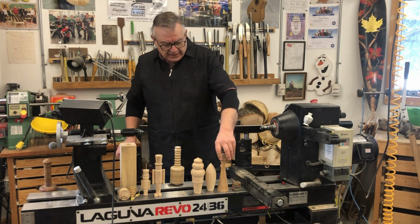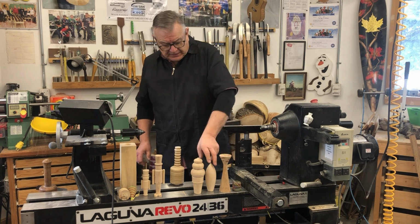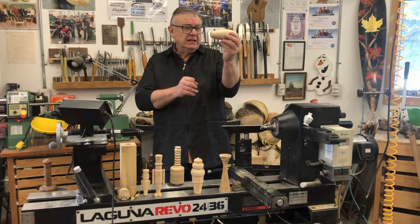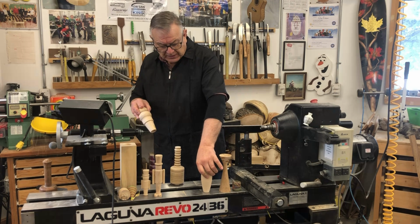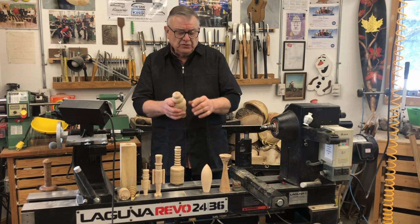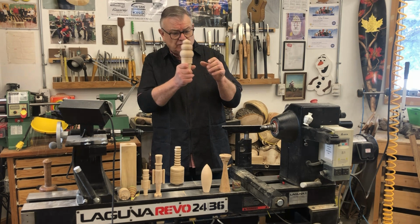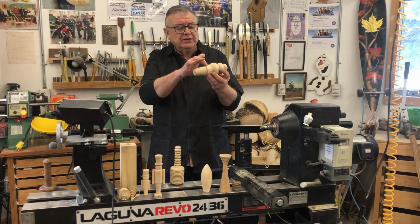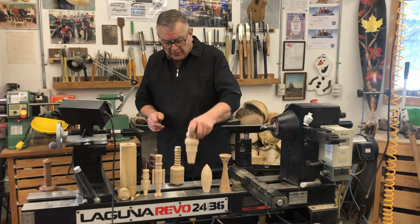So this I figured was kind of a cove. This is a little rocket we used to do, and we put fins on it. So that's a bead, just a nice bead. I really like the ice cream cone because this is a little harder to turn. The students usually, they not struggled, but this was more of a challenge for them because you've got different size beads, and then you've got a cylinder part here with two little beads on it and then a taper. So that was always a challenge.